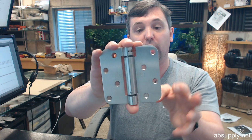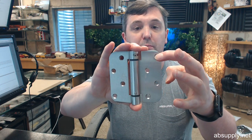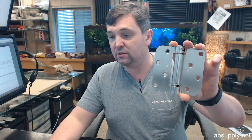The 4382 means several things. It means that it is 5/8 inch radius. It means that it is 96 thousandths of an inch leaf thickness. It means that it is full mortise, so that when the leaves are brought parallel they are meant to be mortised flush to the edge of the door and frame. It also means that the specific location of these holes is for a company called General Products. There is a link below this video to a document called Template that will allow you to review where those precise locations are — review that to make sure it's going to fit your installation, because the leaves are not symmetrical.